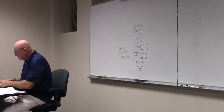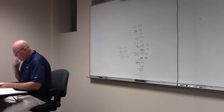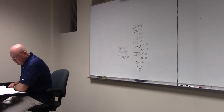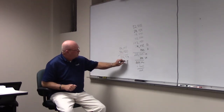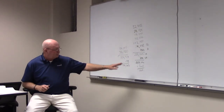But now let's look at table 220.84. It says the number of units. So how many units do we have? 30. That tells us our demand factor is what? 33%. So we're going to multiply that by 33%. We'll get what? 182? 348. All right, so that's what we got. That's for our apartments.